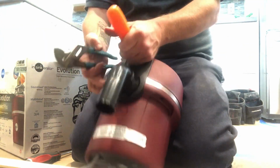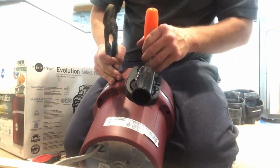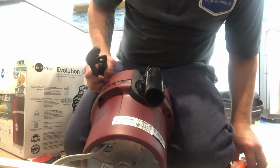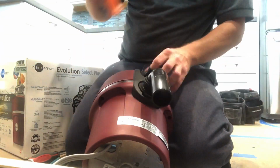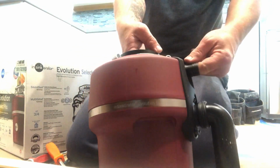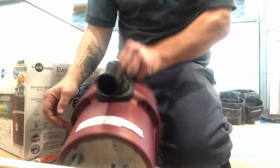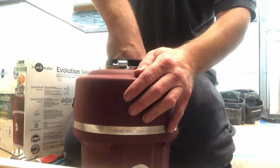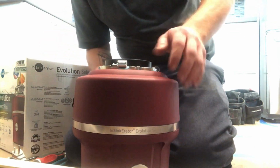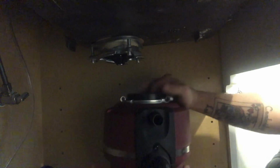So if you have a dishwasher, guys, you're going to want to knock this plug out here. And I advise not using a 4-in-1 screwdriver like I did here. I would use like a big long flathead or a chisel of some sort. The 4-in-1 for some reason always breaks a little plug apart, when if I use a big long flathead, which I'm missing mine right now, I can get the plug out in one piece. If the plug breaks apart, guys, you're going to want to make sure before you install that disposal, you get all the little black pieces out. Because what will happen is those black pieces will get lodged in a certain area in the disposal and they'll make it sound awful. Or they'll jam the blades, one of the two.